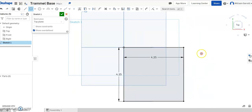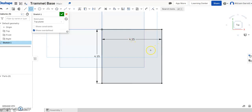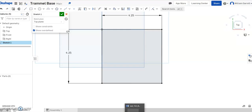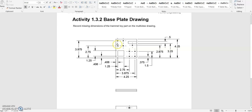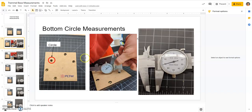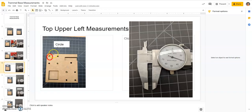I'll click top to recenter my view so we can see it a little better. That gives me my overall shape. Next, we have four holes on the upper left-hand side. We're going to start with the upper left-hand hole. Looking at our previous assignment, it's a circle. We'll go to three places after the decimal — it's 0.230 for this one, for our diameter on the circle.